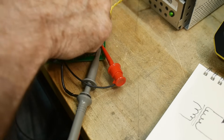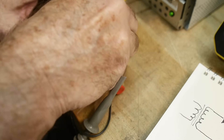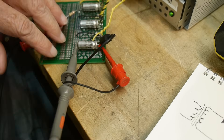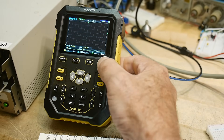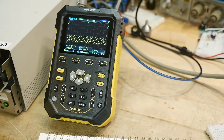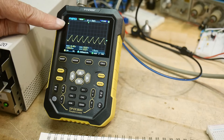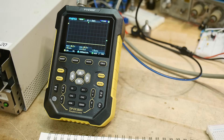It's mostly semantics. I'm going to take my ground lead and connect it on the 'wrong' side, and connect the oscilloscope probe to the 'wrong' side. It's just upside down — here's ground and we've got negative volts. Without the load we have negative 10.2 volts, and with the load it does the same thing but upside down.